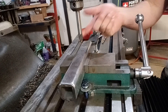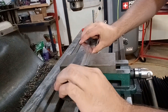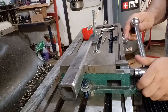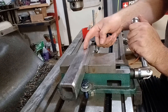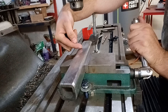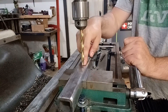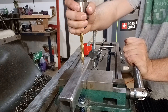Before you tap your hole, you're going to want to put a little bit of a chamfer on it so that when you do tap it, you don't have a raised burr. Next, we're going to rotate 90 degrees, push it up against the same stop, and clamp it down. You're going to put another hole in the exact same X dimension, but offset a little bit in the Y so you don't have to cut the bottom of your shoulder bolt off. Otherwise, your shoulder bolt could hit your 1/2-13 adjuster screw. This hole is for the 1/2-13 adjustment screw, and the pre-drill size for 1/2-13 is 27/64ths.